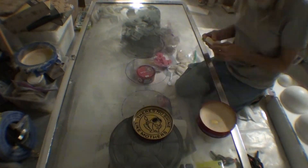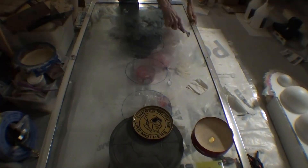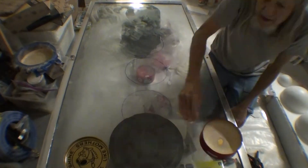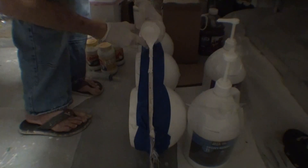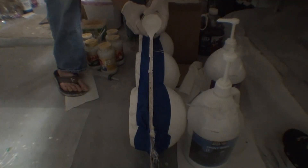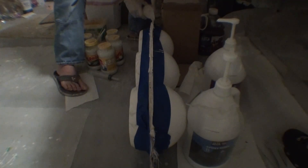I love this — you can hear when the glass gets clean. Now that the glass is clean again I'm going to put a bunch of layers of paste wax on it to get it ready for laying up more fiberglass parts, or more silicone, or whatever gets done there next.